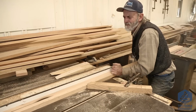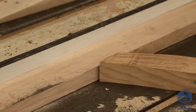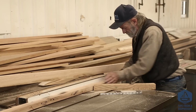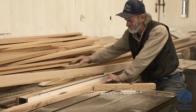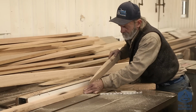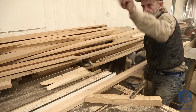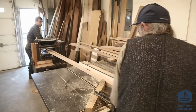Now I've clamped a wooden leaf spring down on the table saw right here. It's made out of a piece of white oak, and it's kind of like 1/8-inch layers, and it's pretty flexible, but it's really pretty, it holds a nice pressure against the piece that I'm trying to rip, because the piece I'm trying to rip is not necessarily all that tame. You know, it's kind of curved in different directions, and you have to hold that pressure up there tight. It's like having another person with you, really.